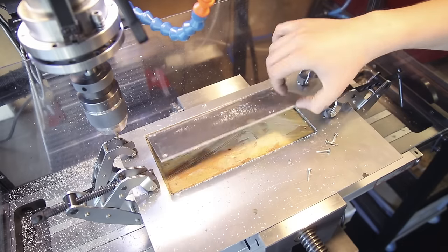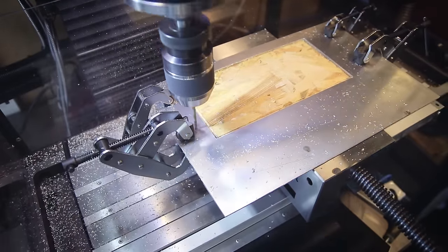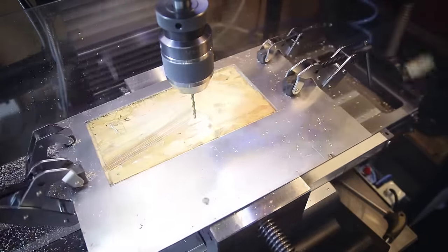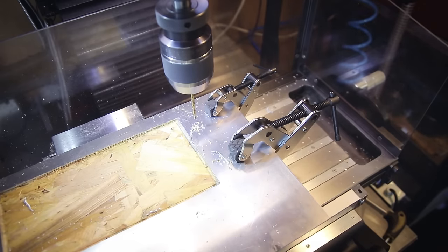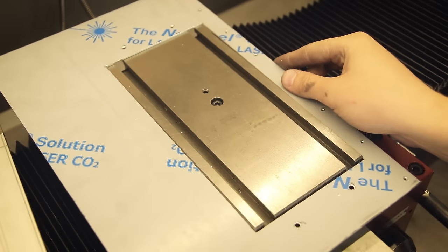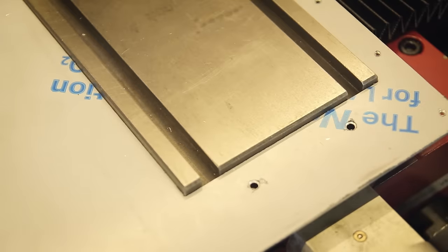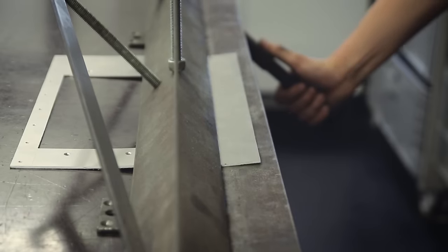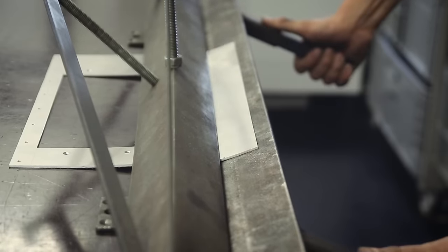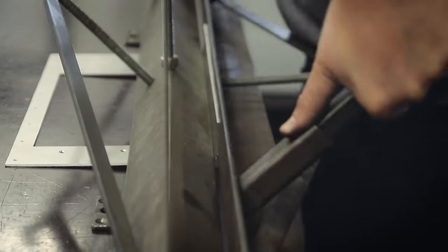I put the screws in the middle so that the holes are in the piece that I don't use, and now it's just missing some mounting holes. Doing a test fit here, and this came out really nice - it fits around the cross slide with pretty much no gaps, so that's going to make sure now chips are not going to make it past. On the spindle side, this gets a folded edge to cover the glass scale, and my DIY metal brake is a bit too flimsy for this job, but I did manage to get it done somehow. Before I can install the cover, I need another support surface in front of the cross slide, and to prepare the mounting points for that I have to unfortunately disassemble the whole handwheel because I can't get in there with the drill otherwise.